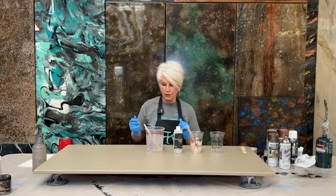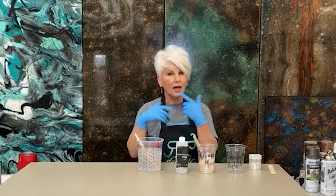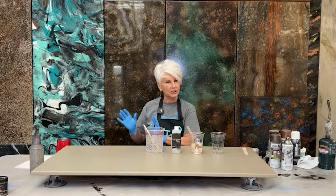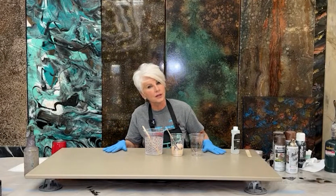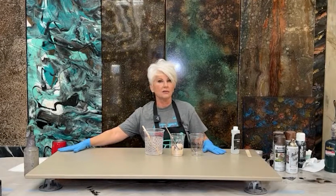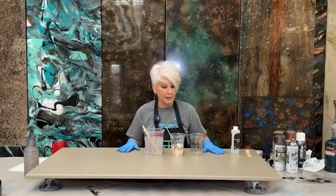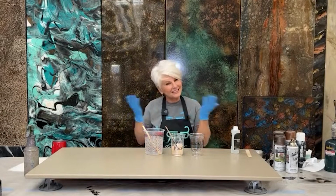Tonight, what we're going to do, we're gonna start off with one kind of finish. If Alan Chambers is out there, this is for you, my dear friend. We're gonna kind of modify that Alan Chambers effect, and we're gonna get a really cool finish. We're going to be starting with a sample board. This is 3/4 inch MDF. And what we've done is we've rounded over the edges with a 1/4 inch round over bit. We, as in Kenny, he worked hard, y'all, today because I was in the hospital.